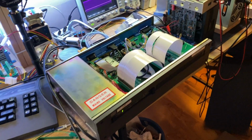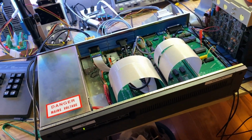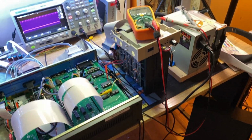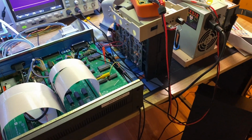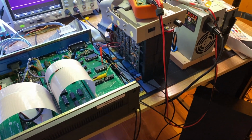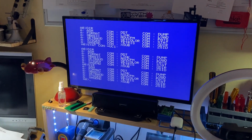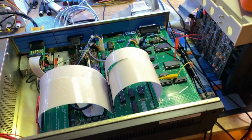But I moved the NABU downstairs back into the lab, the one that has both boards in it, to try and diagnose and troubleshoot. At which point, the floppy drive stopped working. Of course, why would it be easy? There's no reason it should be easy. It lights, it tries to go, and it just won't boot. But anyways, deal with that later. So I got the GoTek, flipped it back around, GoTek boots. So I get it back up and running again, and there's LeBaum's CP/M 2.2 coming off the GoTek. But anyways, back to this.